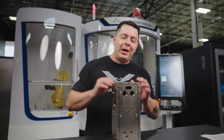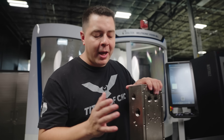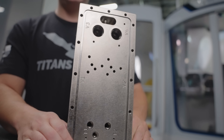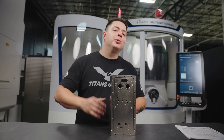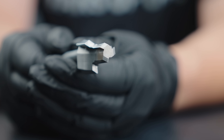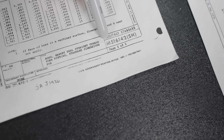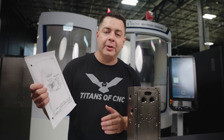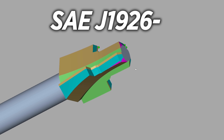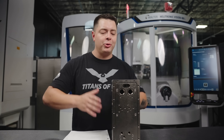Check this out — this right here is a manifold, a crazy beautiful part. These aren't just drilled and threaded holes; they're made with something called a port tool. A porting tool is a standard across the industry, made to an exact spec. The part we're going to be making originated from an MS16142, the military version, but we're going to make an SAE J1926-6, which is for the civilian market.